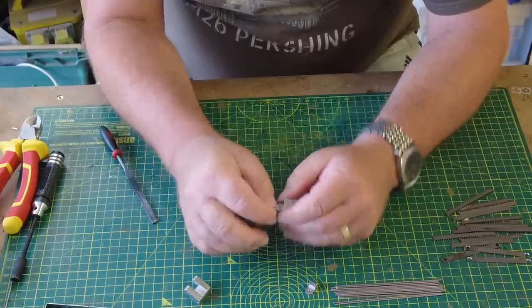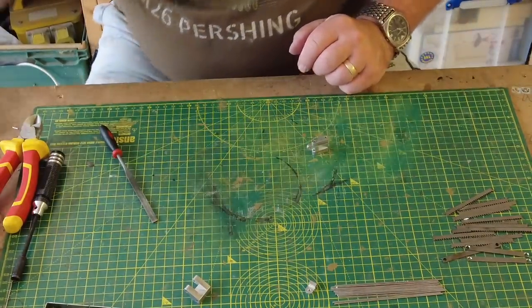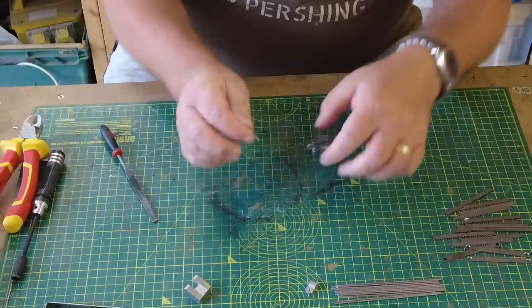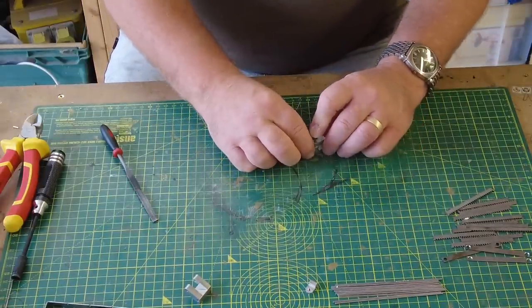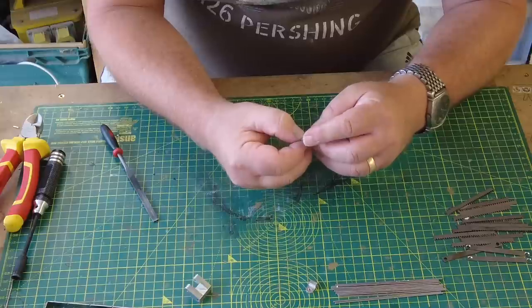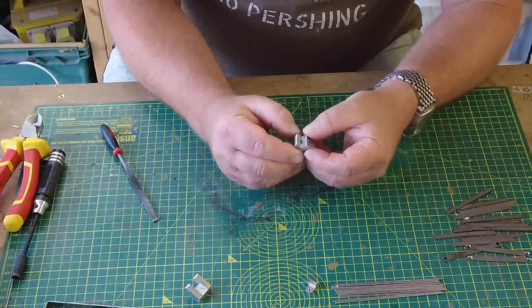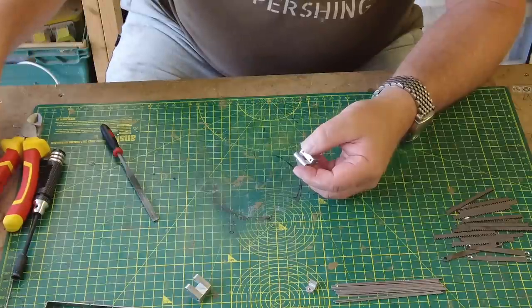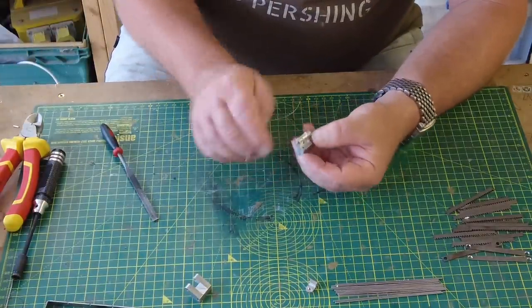What we'll do is I can actually put the pin in those now. We might as well. So these are these 20mm M3 pins. And again, these should be put in so they're a reasonable fit, they're straightforward. Look, this goes nice and easy. And that's it. Now what I want to do with that, I'm going to use one of these offcuts, pop that out, and then I'm just going to put a little bit of thread locker.